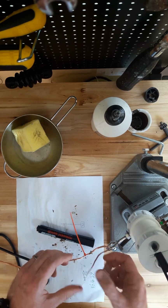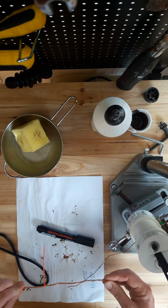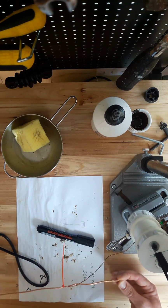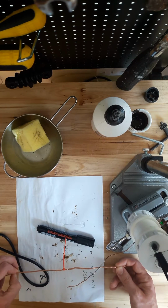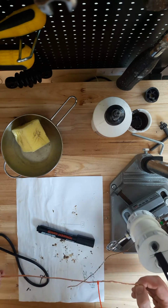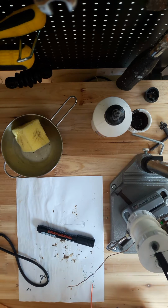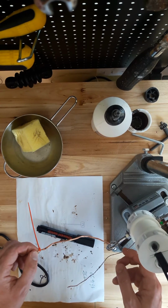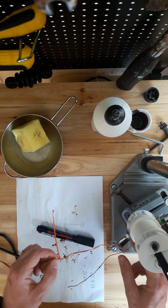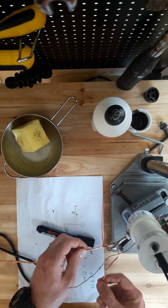Okay, now this particular doublet is a half wave on 40 meters, so that's 20 meters, so each leg of the antenna will be 10 meters long. I just marked off 1 meter length on my bench here, and using that I marked off 10 meters of wire. Be aware when you're constructing the thing to leave excess to create the loop to solder, because you want it to be 10 meters exactly.